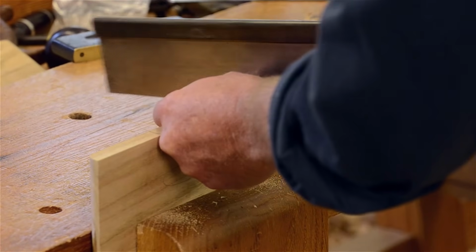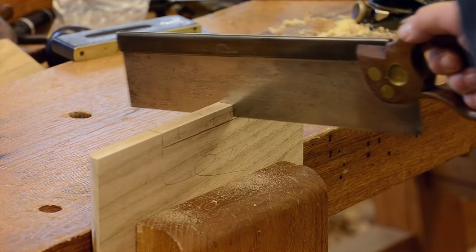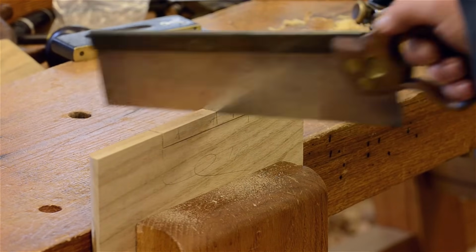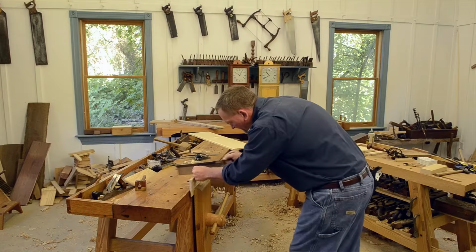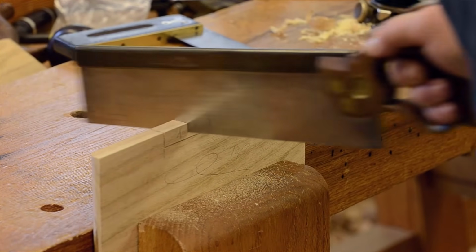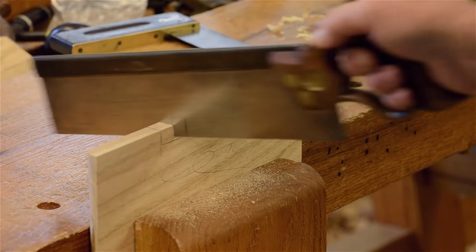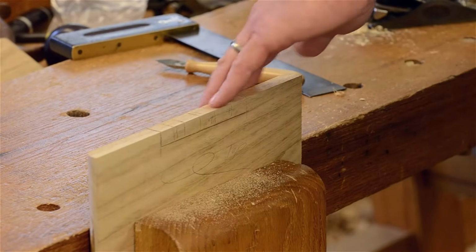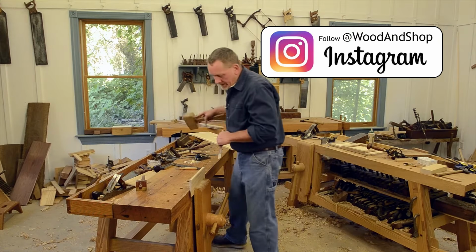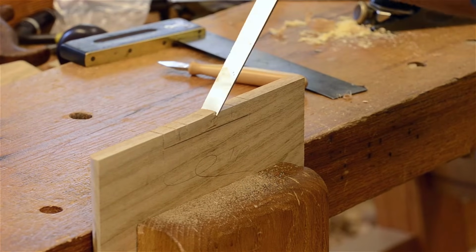And then I'm going to come back through here and make just a few little relief cuts, just to help us break these chunks up, break this waste up and get it out of there. Okay, that's not too bad. So now we're going to just chisel and mallet here, and we're going to start kind of slow, even though we've got this cut up in pretty small chunks.